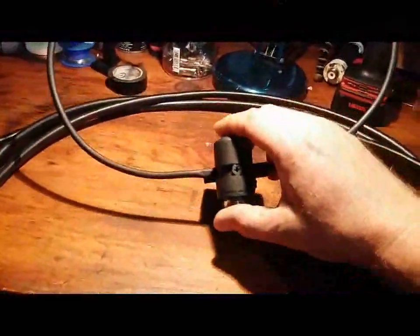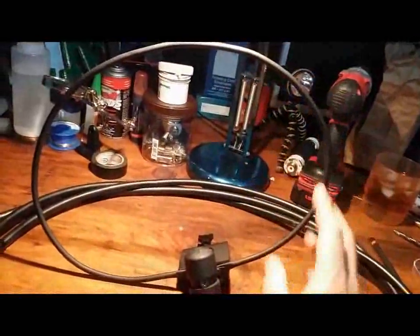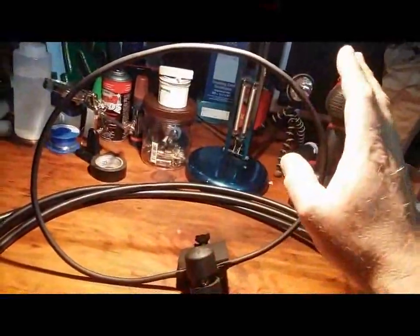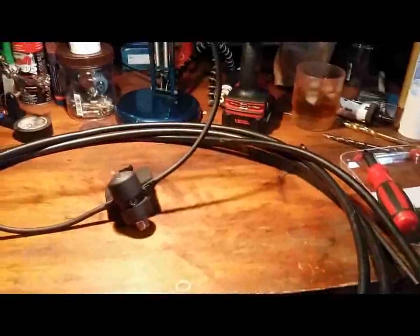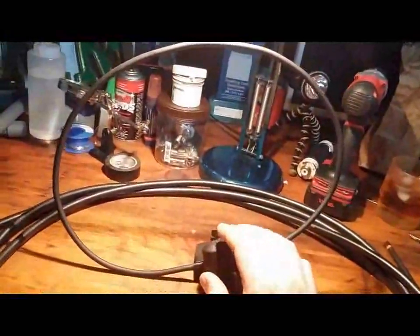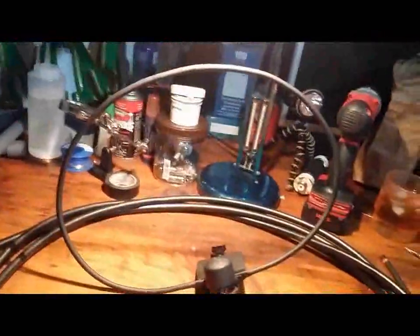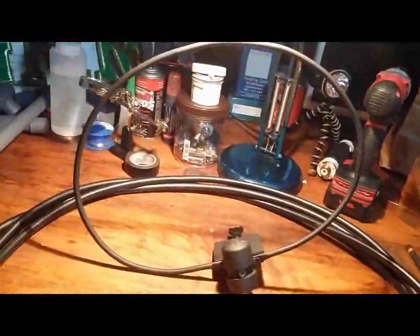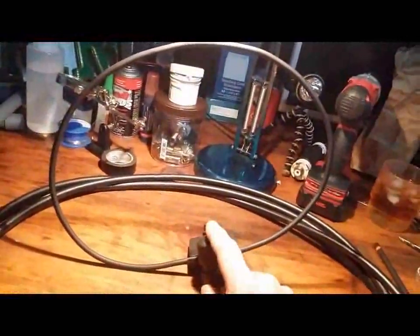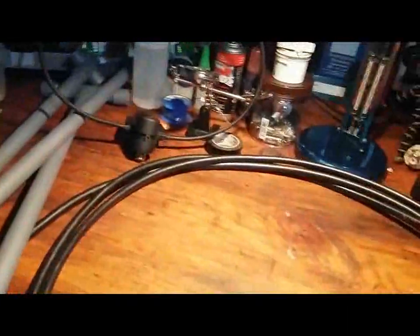I think that's pretty much proven at this point, so that's why this is a little elliptical. That's the coupling loop. You can even use coax — RG8X, RG58, whatever you want — or even a piece of wire for the coupling loop. I have 14 feet on the secondary loop, so your coupling loop needs to be one-fifth the size of the secondary loop. Just take whatever your circumference is — let's say 14 feet — multiply that times 0.2 and that will give you the circumference for the coupling loop. Pretty easy. It will work, I guarantee it. You don't want to go bigger. I always go a little tiny bit shorter than one-fifth.